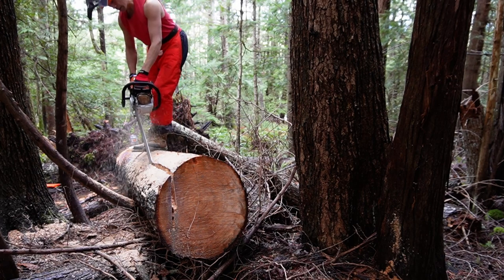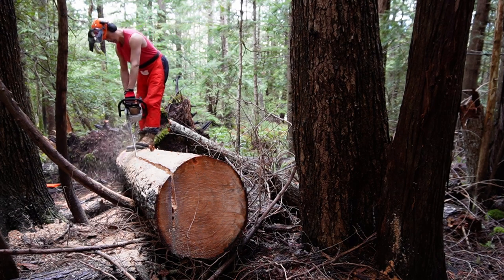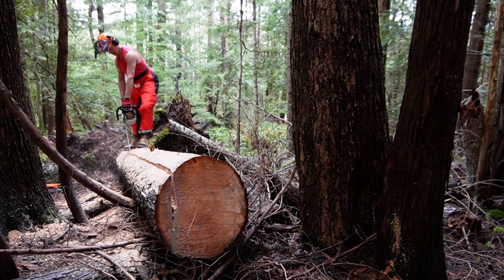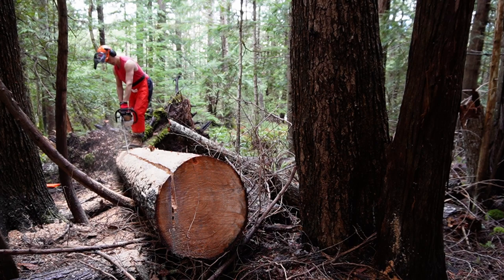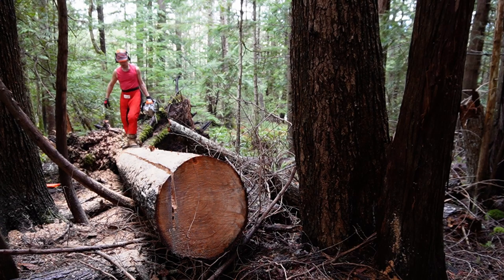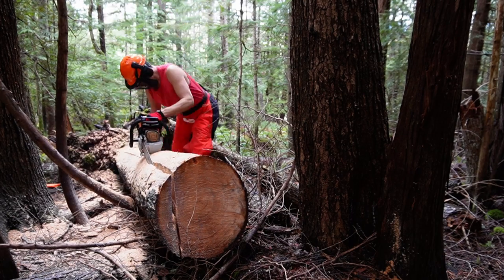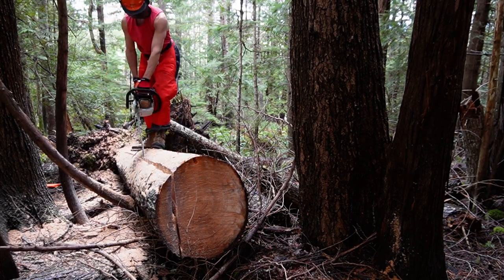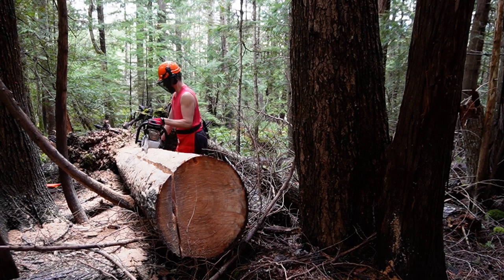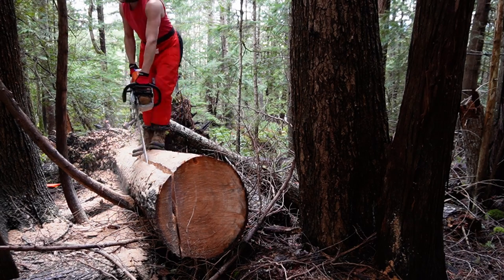I think I made a mistake at first — that was trying to cut little by little as I worked my way down the log. It's better to first cut all the way along the line, because as you cut it produces a lot of sawdust that will hide your chalk line, but if you make a little groove it'll be easier to see what you're doing. When I started I was a little bit off vertical — I think that's lack of experience — but once you've got that groove or cut vertical in the tree it's very easy to follow it. My main problem was standing on the log and you tend to get a sore back. In future it's worthwhile to put a plank along the log to make it easier to cut.